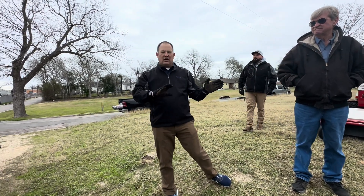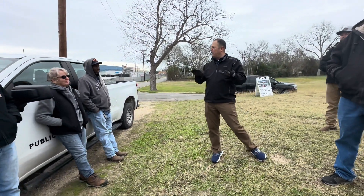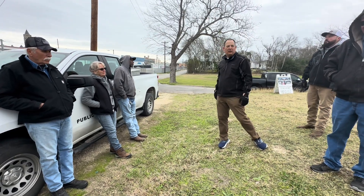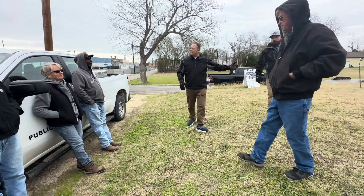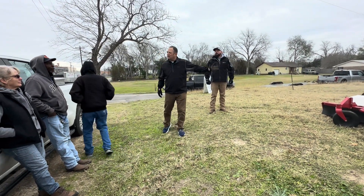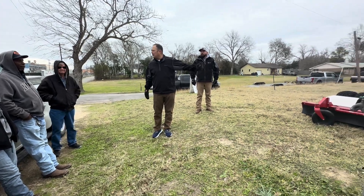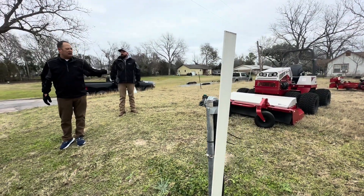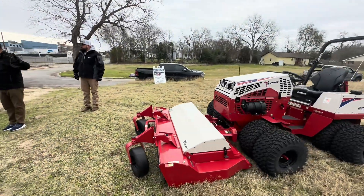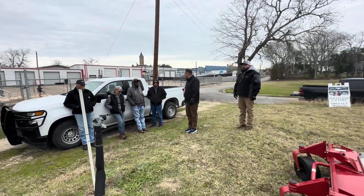We've got a very low profile, so tipping is really hard to do because of that low profile, your wide stance, and your articulating frame. This tractor is set up to maintain a 30-degree slope in any direction. Standard with four wheels and tires would be a 20-degree. But with the dual wheels, we get that increased slope rating while also lightening our footprint — distributing that weight throughout those eight points of wheels.